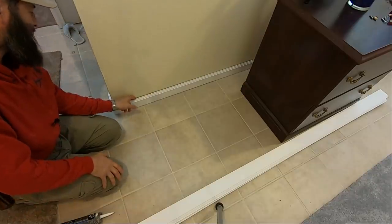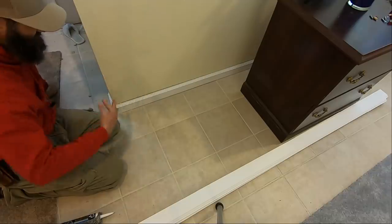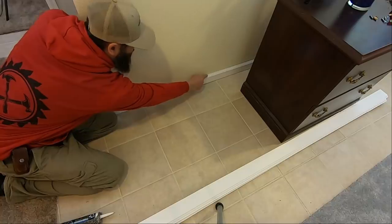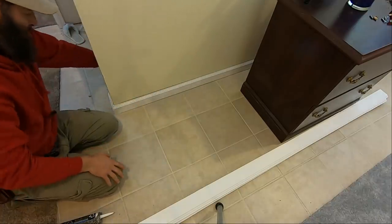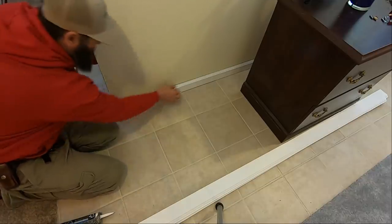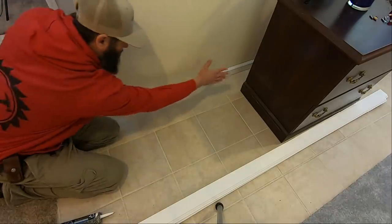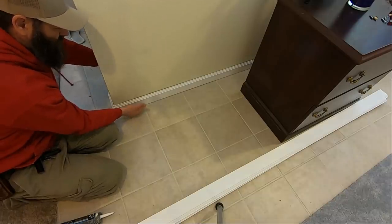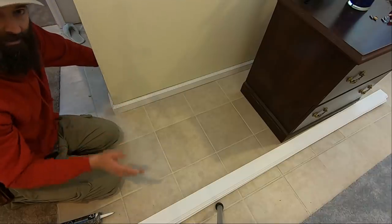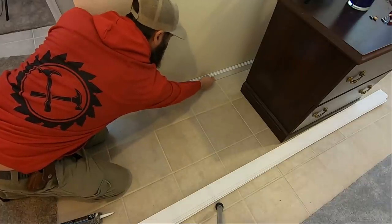Right here is a gap in the wall, and one thing I don't do is force the baseboard to squish in and around everything. I'll go and do my next nail right here on the high point. This all gets caulked in and then there is a straight paint line — it gives the perception that the wall is straight and doesn't wiggle. So the baseboard is straight, the cut-in paint line is straight, and it makes it look like the wall is straight. The next nail goes about two feet down right there, and this little gap stays.